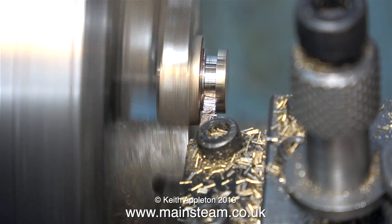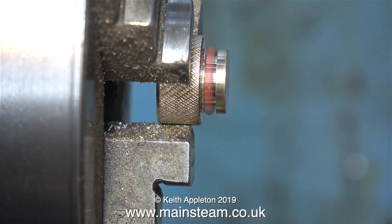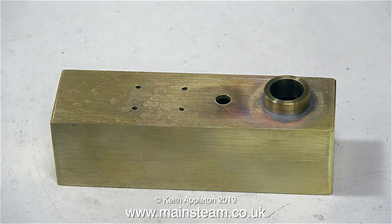The O-ring will hold the cap in place and make sure it doesn't fall out. I looked in my small box of half-inch diameter O-rings and found one — the gap's a bit too big but it will make it easier to remove the cap once it's in the filler hole. And if you believe that, you'll believe anything — the real reason is I didn't have a parting tool of the correct width for this O-ring.